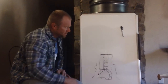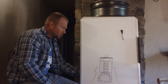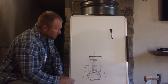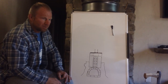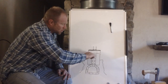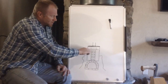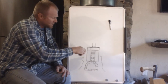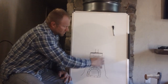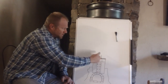Of course it's got a riser in it that's also made out of fire brick. I didn't have the clearance to move my stove pipe in the back and I wanted to go straight up. I also didn't want to burn my barrel out — these barrels only last 10-12 years depending on how much fire you get to them, how hot and how often. So what I did is I suspended a quarter-inch cast iron plate an inch and a half above the chimney stack, and it comes down on three pieces of angle iron and comes within an inch and a half of the edge all the way around. That forces the heat to mushroom down, fill that barrel up, and disperse that heat better, and then it can come around and go straight up.